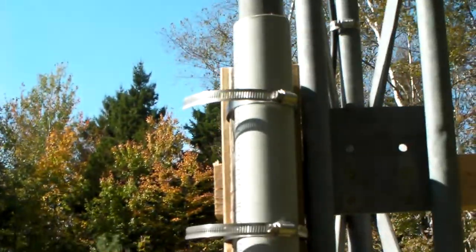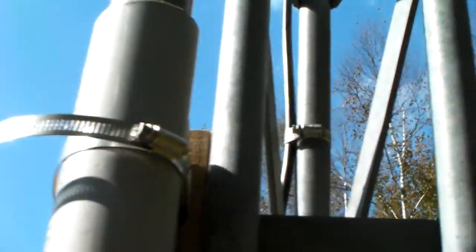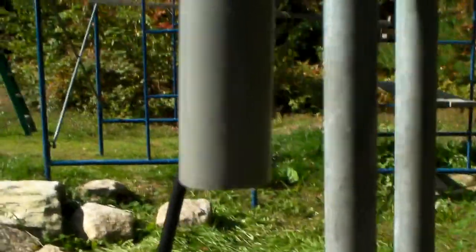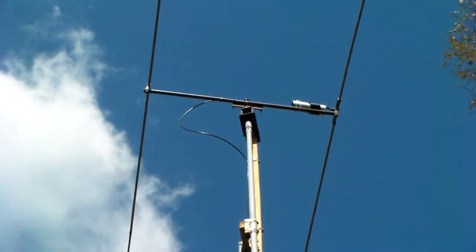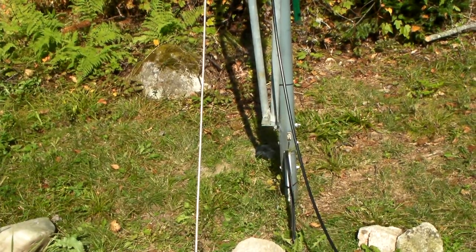I used PVC electrical conduit for the drive shaft, and I have these sleeves up there — they're mostly just to keep the drive shaft from wobbling around, very low friction on them. All the friction is on that thrust bearing I showed you in the first video. Somewhere between here and the ground I still have to rig a platform and mount the Alliance rotor. A little bit of sail rigging — some junk from a silent key sale — and a free Yagi that somebody outgrew. All in, less than 200 dollars in parts, and there it is. I can't wait to see what the reactance is — let's go inside and check it out.